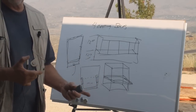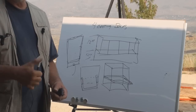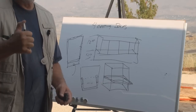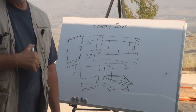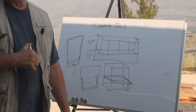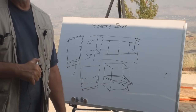I painted most everything I put in the coop — I know a lot of people just throw raw wood in there. If you prime it and paint it with a decent water-based enamel, it's really easy to clean up. Whatever gets on it — bird droppings, whatever — it's pretty easy to clean up with a little soap and water. I think it makes your lumber last a lot longer and shows dirt quicker, so maybe you need to attend more to cleaning your coop than you think.